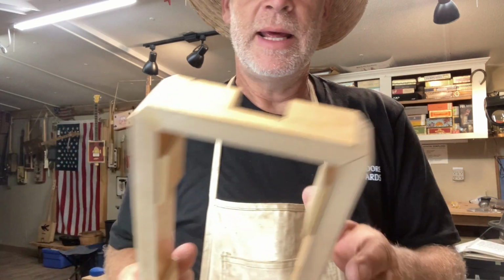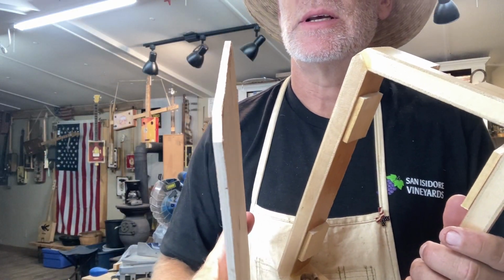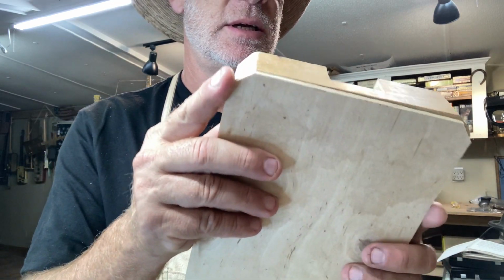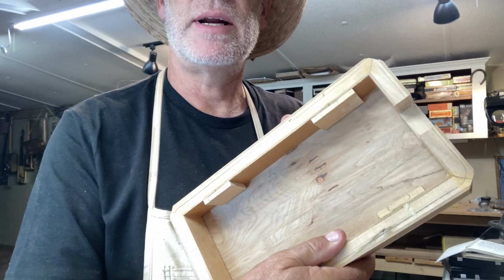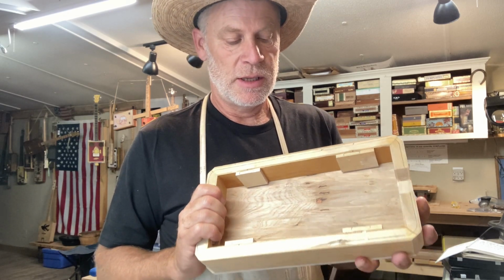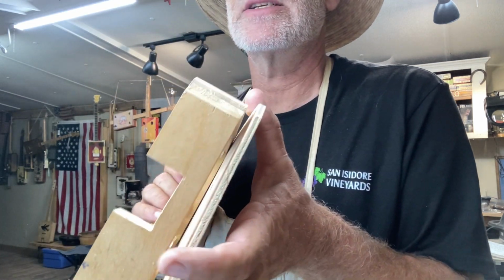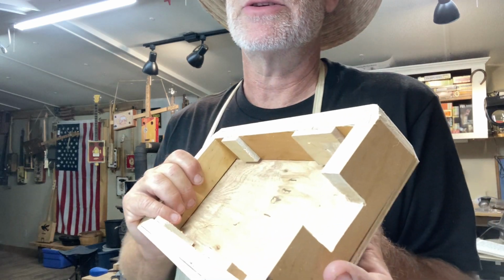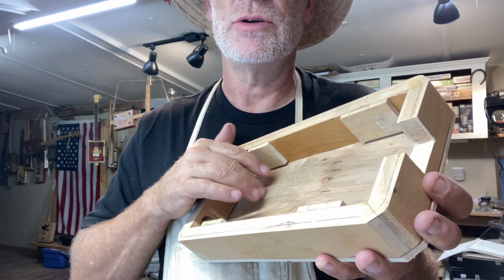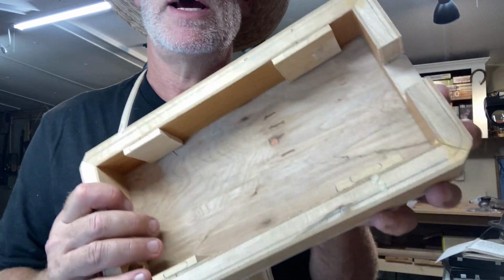Oh yeah, and then once I got this contoured, I traced it out on a thin piece, and this is going to be the back. Why I need this here is because I want to put some springs in here, and I want to have access to it, right? It's not going to make sense to not have a back. You want it for strength, and also to contain the sound inside there. I am going to put some springs in here, like I said, and this will give me access. I'll just unscrew it to get to the back, and it'll also give me something to screw the neck into. I'll glue some blocks here on the bottom. That way I can screw the neck into it so that it's nice and sturdy with the back. So anyhow, that is where we were at now.